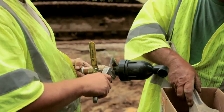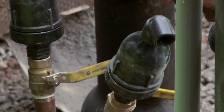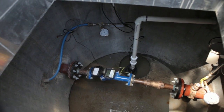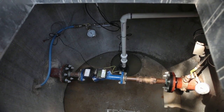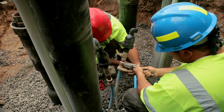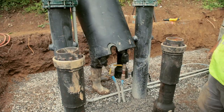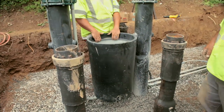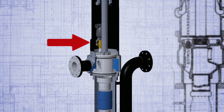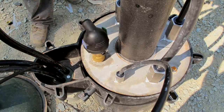At the end of the air line, install a lead-free brass ball valve followed by an air release valve. Typically, the air release system is housed inside the concrete vault with the pressure transducers and pressure gauges. This station houses the air release system in a small vault located between the two pitless booster units. The air line must be housed to prevent freezing. Size 8-inch and larger pitless booster units house the air release on the top flange of the spool within the upper casing, eliminating the air line to the vault.